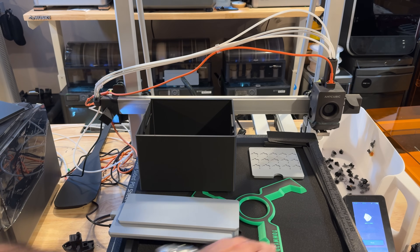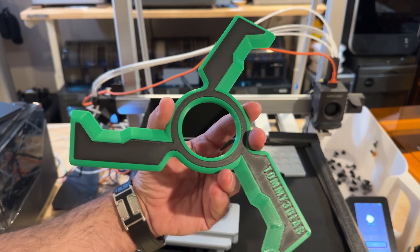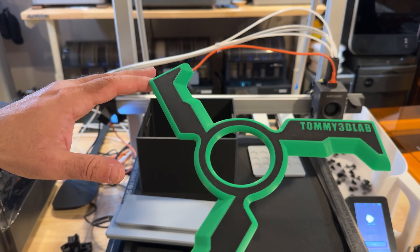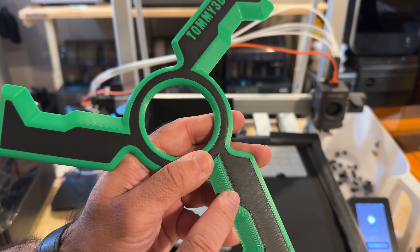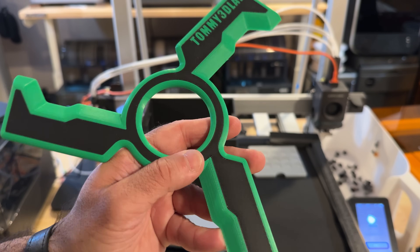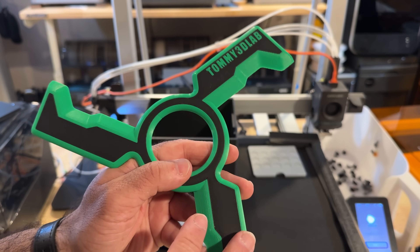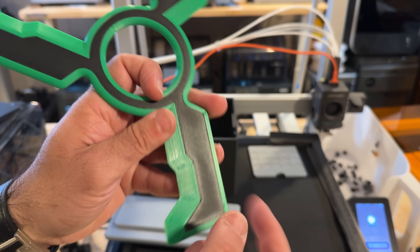We also tested multi-color printing. We don't do a lot of multi-color outside of certain badges and branding, but here's a print using Polymaker PLA in black and green. We didn't do extensive tuning — we wanted to see how it would print out of the box. You'll notice some shiny areas, which have to do with speed and temperature, so I'll need to adjust that to get an even matte finish. We don't do ironing because over time, wear on the print head affects ironing quality. There are opportunities to improve here.